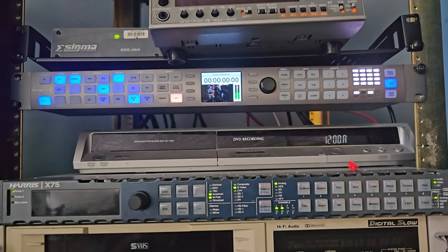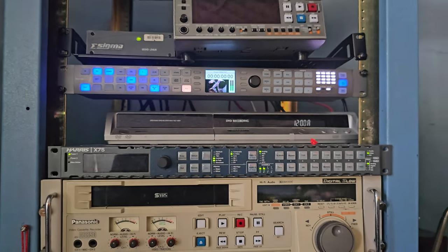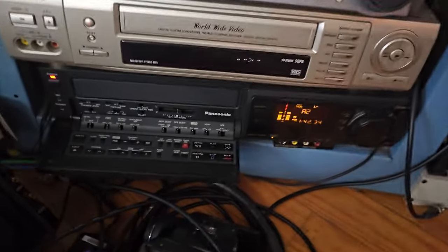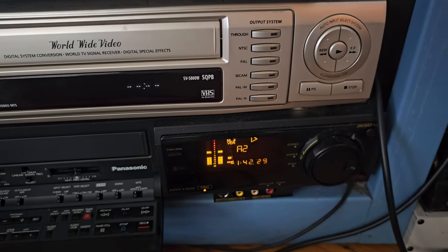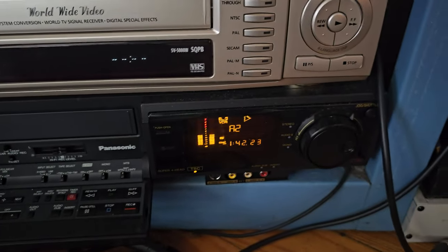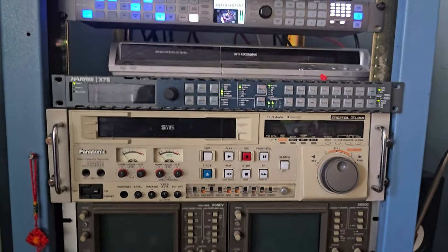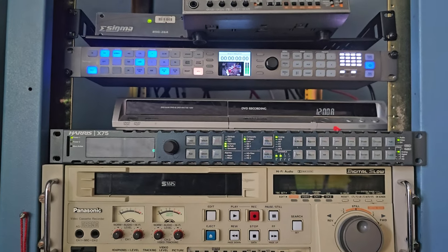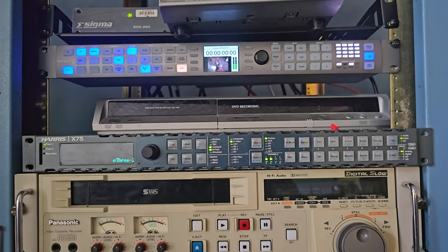The Terranex renders a slightly better result than the MDHX, although the MDHX does, for all intents and purposes, what you need it to do. This system is coming out of our Panasonic AG-1980 recorder, which is probably the cream of the crop — the absolute best VHS machine for digitizing — because it handles standard, long play, and super long play tapes, and it does so with its own built-in time base corrector. So we're actually time base correcting before it even gets into the Harris deck.